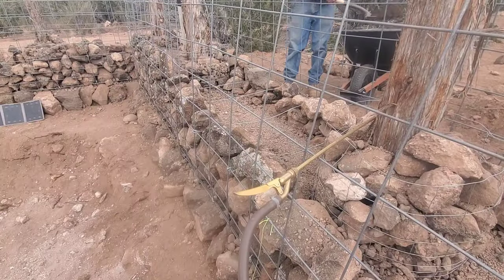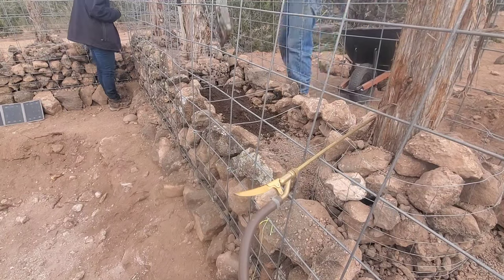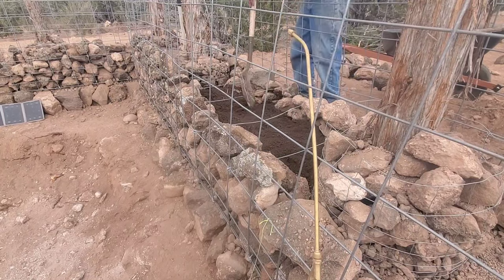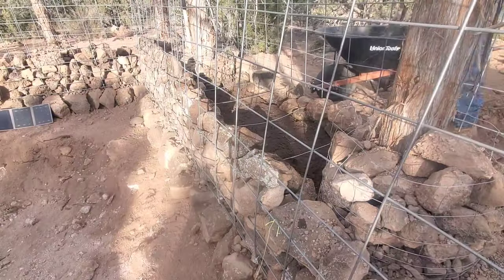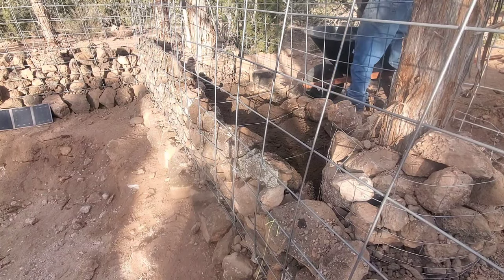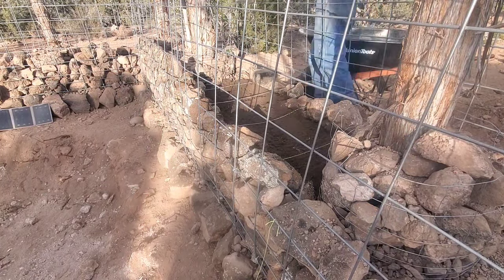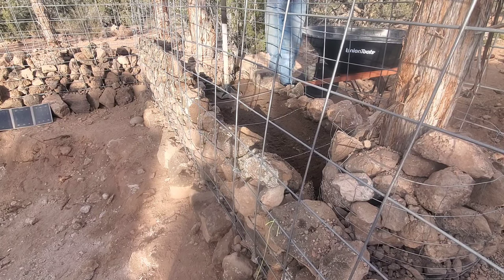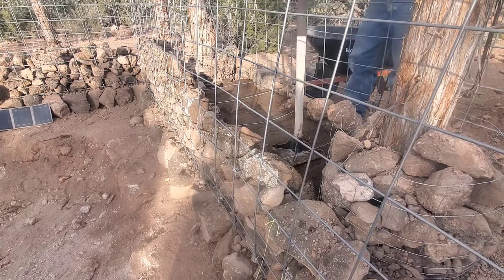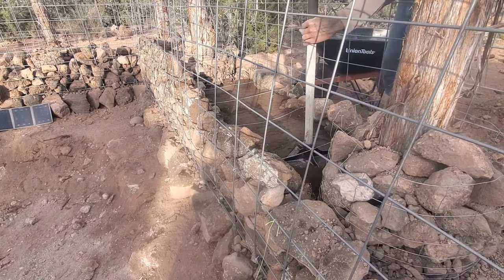So with the wire ties being in the basket, these are going to be our check sections that we're essentially trying to build the rammed earth wall up to at a time to complete each section. It will be pretty nice that these will run through the wall, helping keep the wall together as well as the whole basket. The only tricky part is having to tamp around the wire ties.